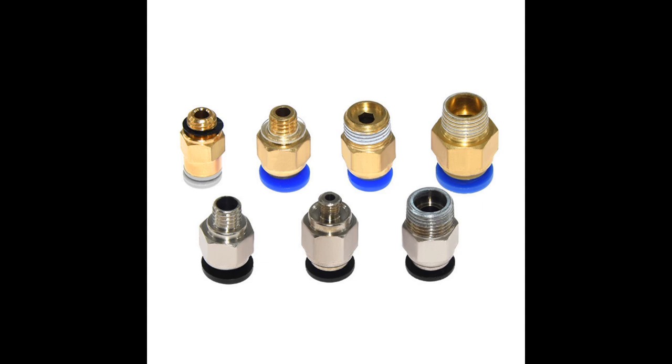5. Crystal collection: A. Vacuum filter the chilled mixture. B. Wash collected solids with cold ethanol. C. Spread washed solids on drying trays. 6. Drying: A. Dry in oven at 40 degrees Celsius for 24 to 48 hours. B. Grind dry products to a uniform powder. 7. Storage: A. Store powder in airtight containers. B. Label clearly raw EDTA extract for laboratory processing only. 8. Handover: A. Transfer containers to experienced laboratory staff for further purification. Estimated yield: 0.75 to 1.5 kilograms of raw EDTA crystals, purity unknown.